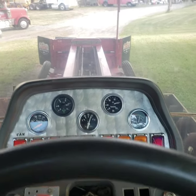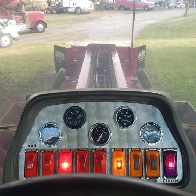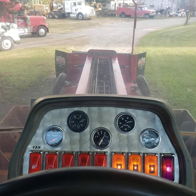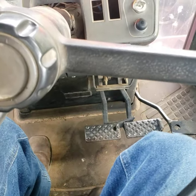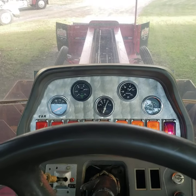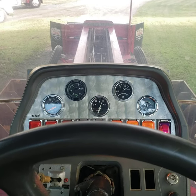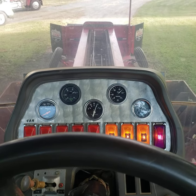That's something extra that's been added as a safety feature. I also use it if a vehicle — let's just say a tractor or somebody — is headed out of bounds with the wheels turned and I can foresee a jackknife bad ride coming. You can stand on the wheel brakes all you want and all it usually does is lock the tires up and slide. But that push-down, shoving those bars in the ground even if the box is halfway up, will do a whole lot better job of stopping and anchoring things to the ground — keep from tail-whipping the sled around into the wall, possibly. That's there not only for emergencies on our end, but for the pullers as well.